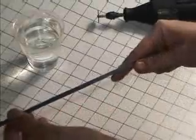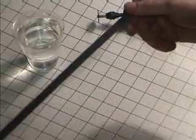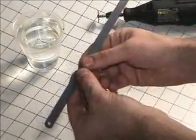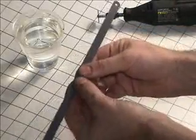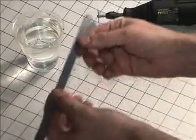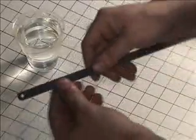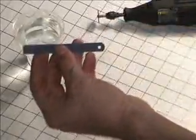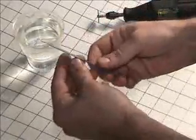Tension tools are made out of the same material. I find hacksaw blade perfect for making tension tools. I would still recommend the 1/3 strategy, although some people would like to go 1/2 and make long double-ended ones or whatnot. There are many different variations, but to simplify, we'll make a simple 1/3. So crack off your carbon steel blade, and away we go.